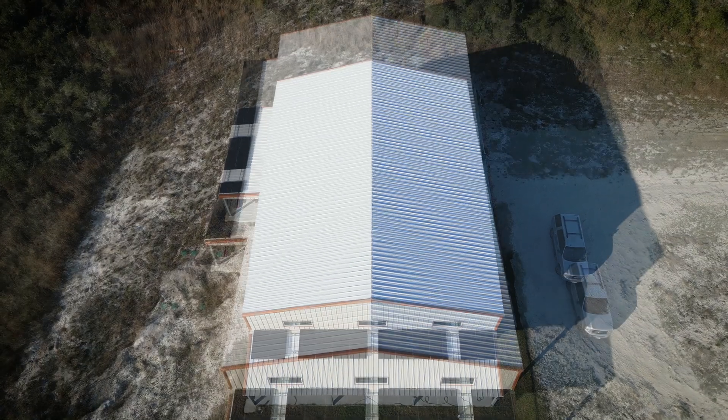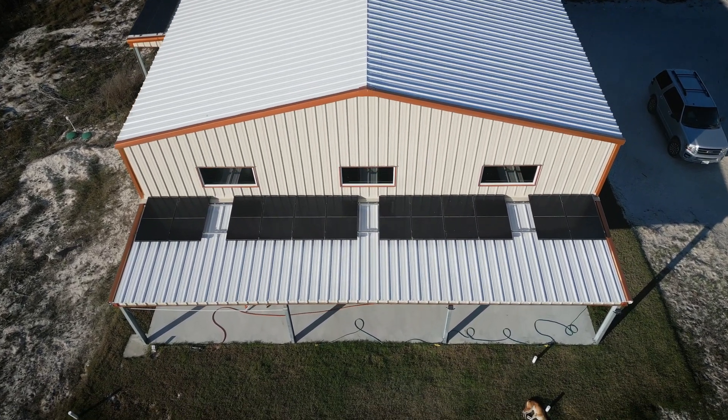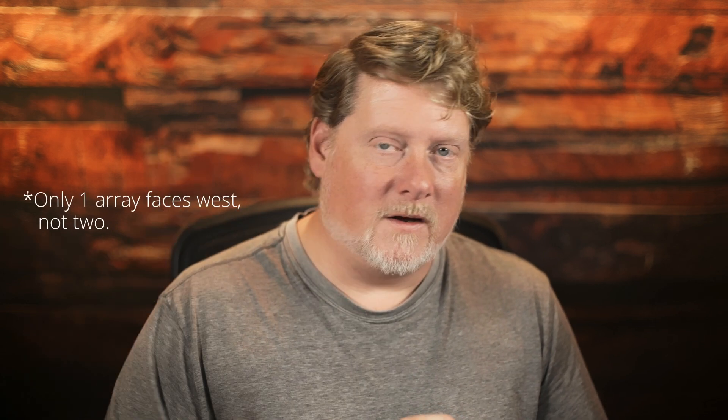I only have two arrays right now. If you look at the solar panel direction video, I go into detail — one array faces west and one faces south. Eventually I'll have two facing south. In fact, I was up on the roof today but only put in two panels because it was a bit windy. I've got six panels left to go, and then all 36 panels will be functional — three arrays of 12 panels each, two facing south and one facing west. They were originally designed to plug directly into the mini splits, and we know that works. But I unplugged them from the mini splits and plugged them into the inverter because I needed all the power I could get to charge the batteries. In winter you're at a deficit — shorter days, more overcast, the sun is lower, so there's less power output.